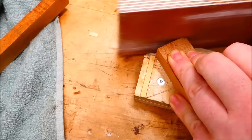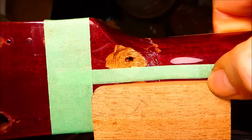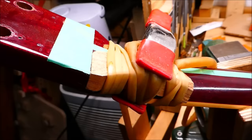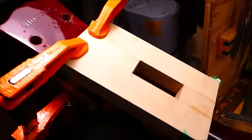To start off, the fit is close but not great, so I'll use a sanding block to refine things, taking little bits at a time, checking and rechecking. That's a nice tight plug. To make carving easier, I'll take some preliminary cuts to get rid of the excess and then glue it in. I use surgical tubing as a clamp, and then I use a clamp to clamp the clamp.